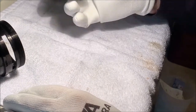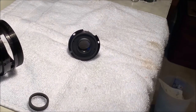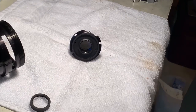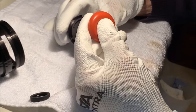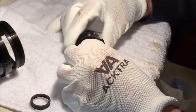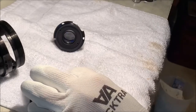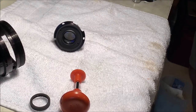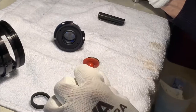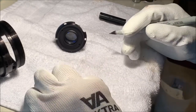There's our first element - it's got some spots on it. That one does not have a safe back end, so I'll get my lens sucker. I really try to keep clean. Is that too big or will this work? It worked. So there's our first element. While I still have it oriented I'm going to take my Sharpie and mark forward with an arrow, arrow toward the sucker.